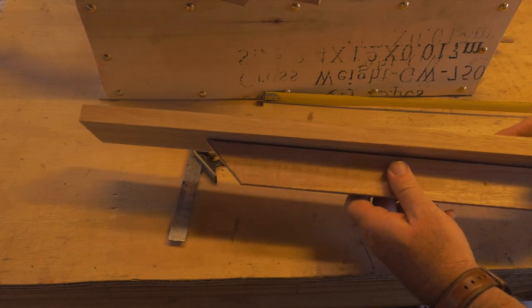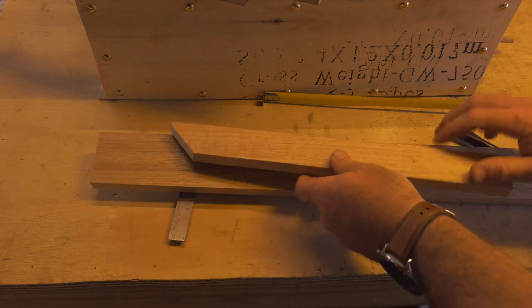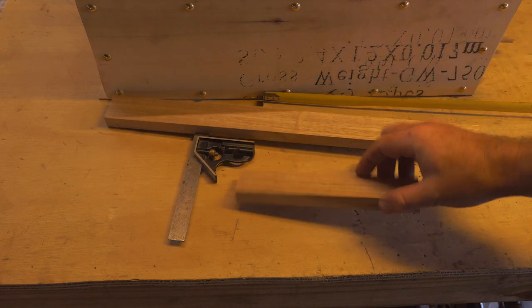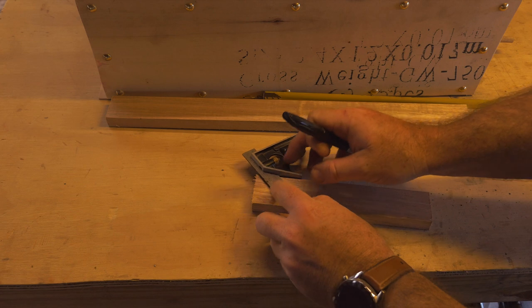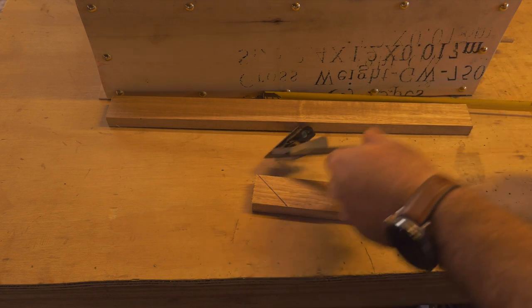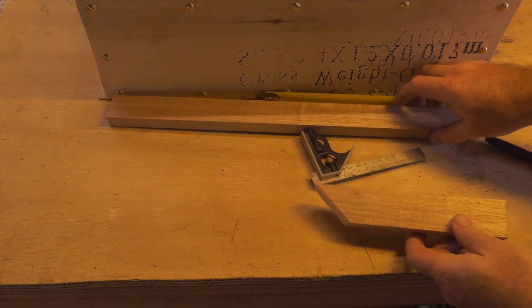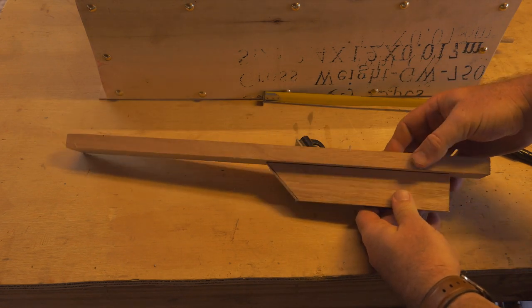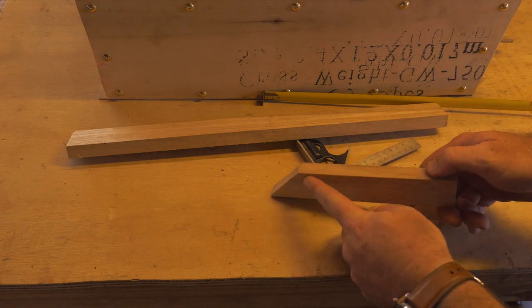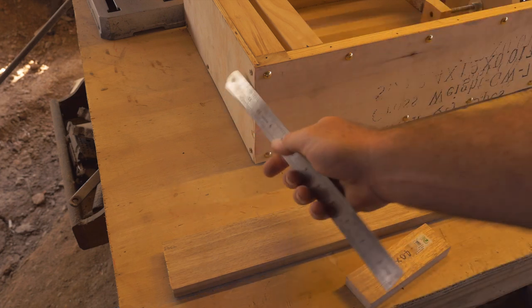You can sand the corners off — I'll show you a little bit later what I do with mine. Now we're going to move on to the small neck lower support and do the same thing. I'm going to measure the 45-degree angle at the very corner just to make it look more pleasing and not so sharp, then cut that. Again, we can sand it down — not on the leading edge which is touching the wood, but you can sand the rest to take those edges off.